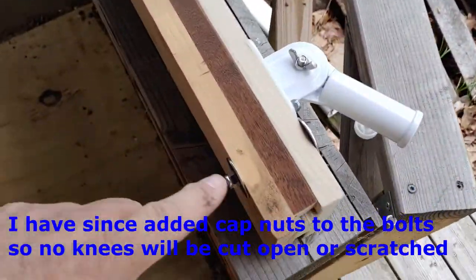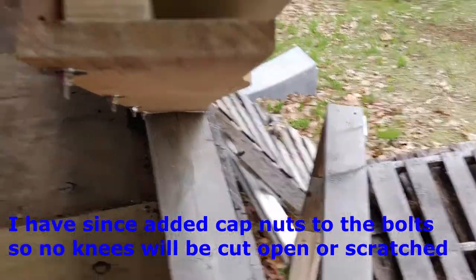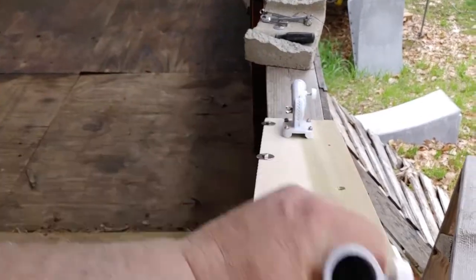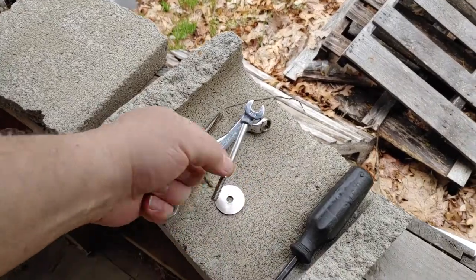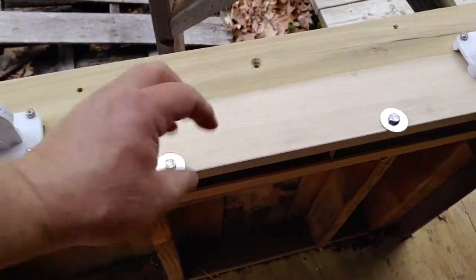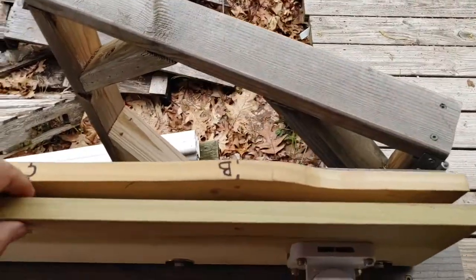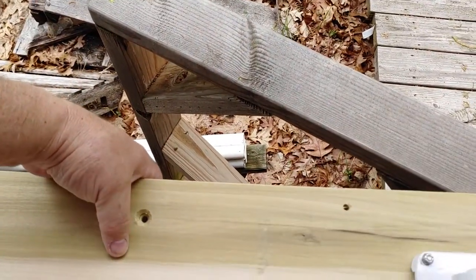We're through bolted now, all the way across. You can see the gap the yoke's going to slide into. 3 inch stainless steel with fender washers, both sides to displace the load, the pole. Those three ABC pieces, you can see how they're going to go in. So let's install this.